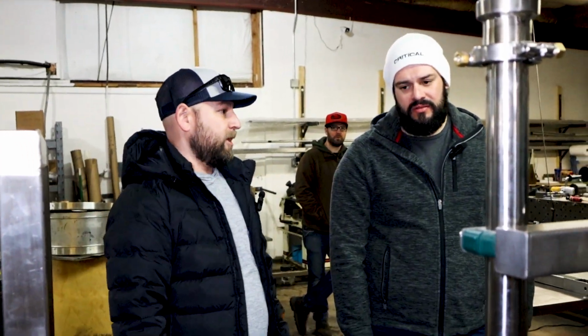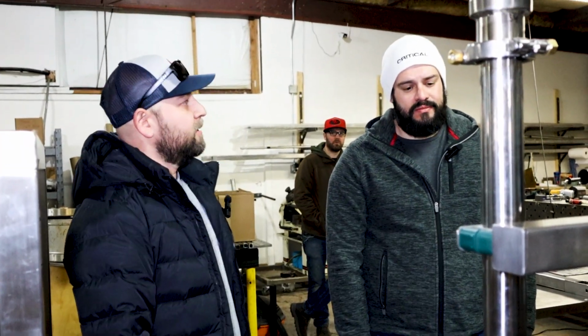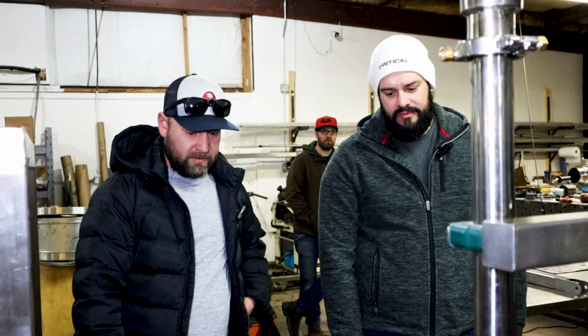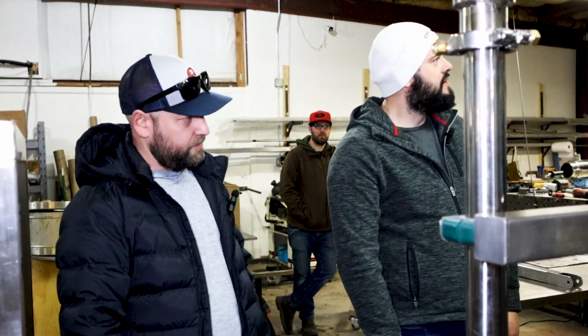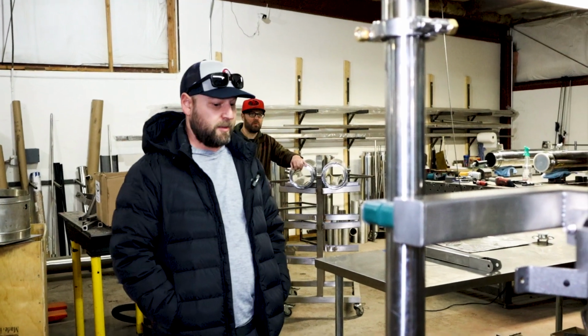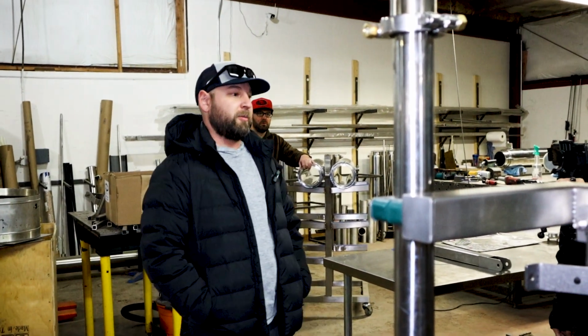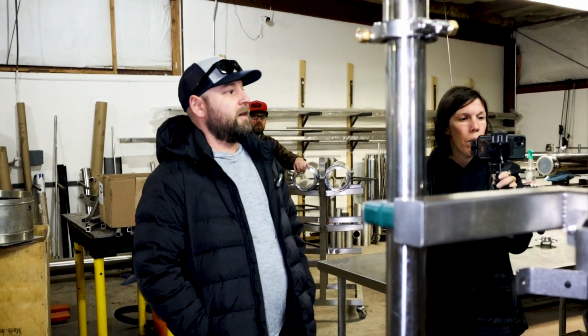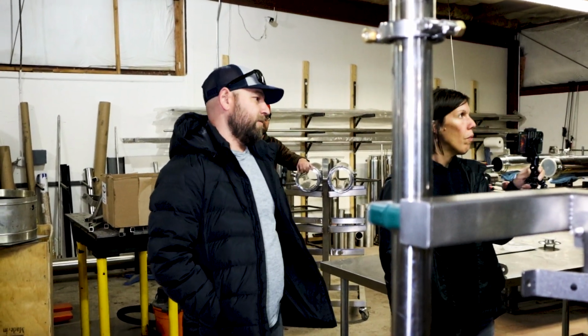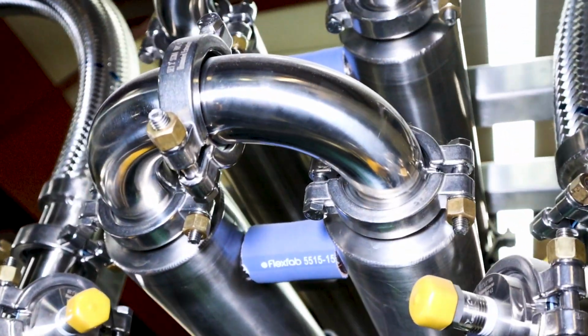Of course. So the whole system is really driven by the compressor, so everything's looped. So it's moving. And they've got two Corken compressors. Very cool. So you can tell that one is for your process and one is for your utility? Yeah, it's like two closed loops. We have a process that runs refrigeration, hot and cold side, and then a utility that runs the hot and cold, and then a process that runs the extraction.